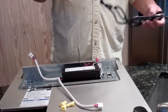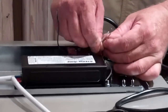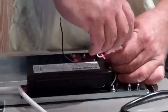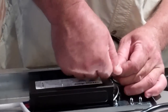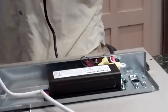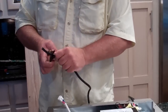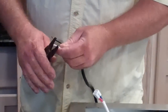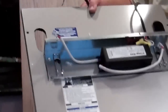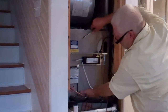In the packet comes an electrical cord with a grommet — it snaps in nicely. We'll make our terminations and tidy up the ground. Due to the fact that we're going to hardwire it in, we're going to cut this plug off, but leave enough in case I want to use the plug again one day. Now we'll go ahead and clean the ends of the wire so we'll be able to make terminations with it.